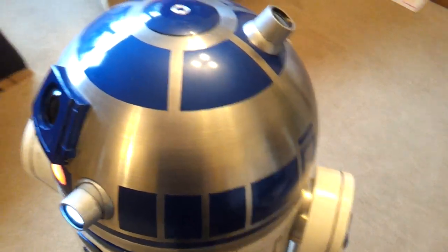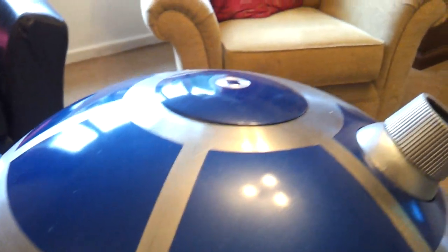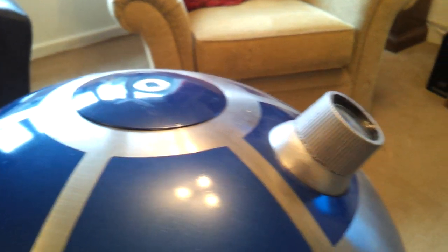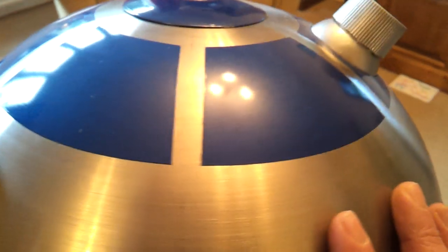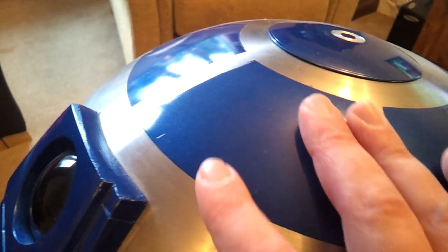As you can imagine, stainless steel is really hard — a bit of a bugger to cut. But you can get some tungsten carbide hole saws and cutters, which you can get off eBay for about 10 to 15 quid for a small set from China or somewhere. And then once you've done that, you've masked and sprayed, you can see it's a pretty good finish.